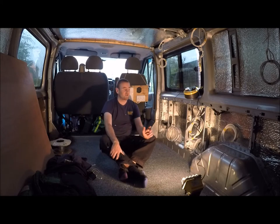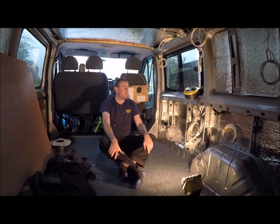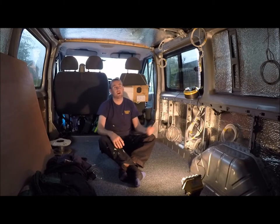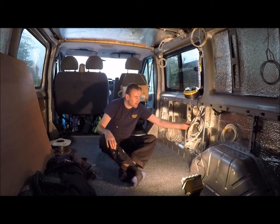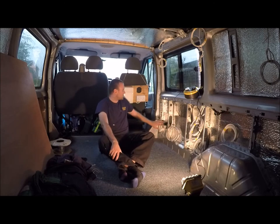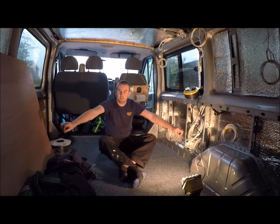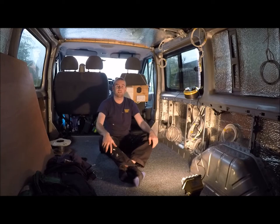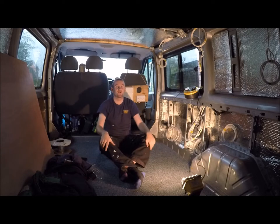After speaking to my electrician friend, I've decided to have both twin core and tricore in place. The idea is I'll use the twin core to start with, but if at a later date I want to upgrade to the tricore it's already there so I don't have to take off the side panels. A tiny bit of extra effort, but the cables are in the walls and if I want to upgrade my lights later I just pull the cable out from the hole. I've got all the cables in place now, tied up neatly and ready to go.